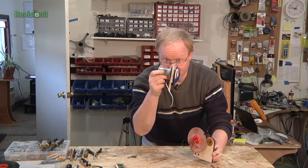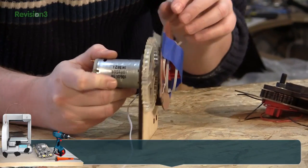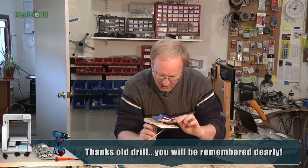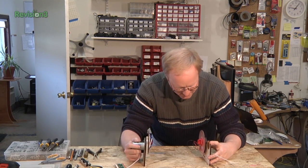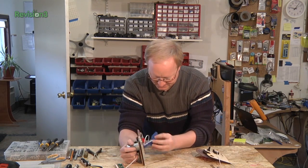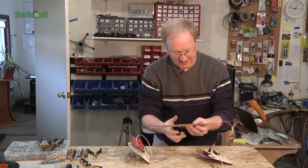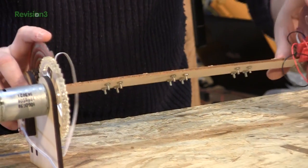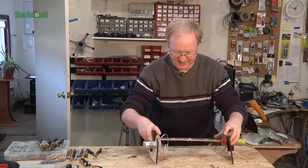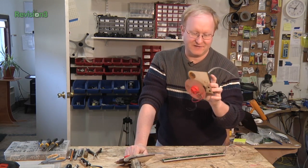I've attached a much larger motor donated by one of my old drills and I didn't have to change too much. It still has a lot of friction from the carbon brushes but I think it'll work. Here's the opposite side — they're mirror images of each other and between them we will attach the spinning portion. We built this in the last episode although we need to make a larger frame. This will basically slot in and then spin, hopefully creating the persistence of vision effect. We've got three lines on this side — data, clock, latch — and two lines on this side for power and ground.